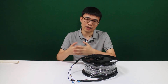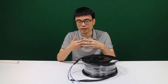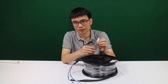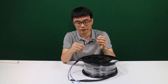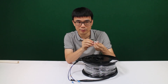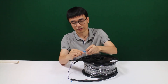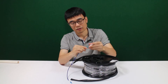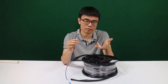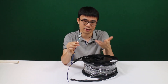The next question is: how do I know which kind of fiber optic cable I can use? The answer is determined by the SFP transceiver. The fiber optic cable attaches to the SFP transceiver, and the transceiver is inserted into your switch or media converter, just like this. The SFP decides what kind of fiber optic cable you can use — single mode or multi-mode — and what kind of connector: LC, ST, or SC.